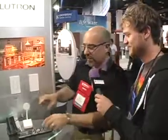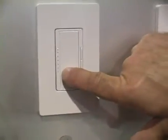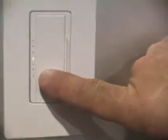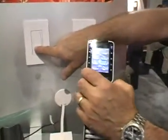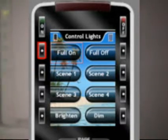What we do is go and address them. You need two hands. We're going to press and hold this dimmer. The dimmer goes up, light goes up, and it's for eight seconds. The reason we wait eight seconds is we don't want any of the young ones in the house to come in and unprogram a scene. You see what's happening now — the way the LED is moving up and down — it's ready to be addressed. We keep holding that button. I then take my remote control here, and while I'm holding the dimmer button down, I press and hold full on. Watch what the LEDs do. That's it. We've now addressed it.